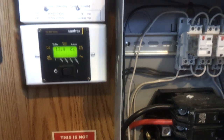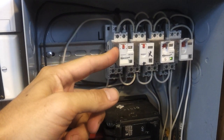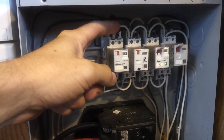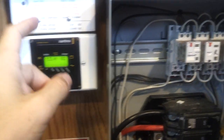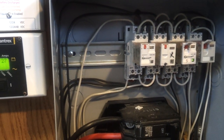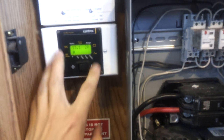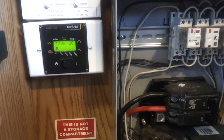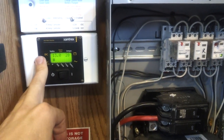That's why you need a double-pole double-throw relay — it switches the neutral as well. If your inverter didn't bond ground to neutral, you could get by with a single-pole double-throw switch. But to conform with electrical codes, you pretty much want your inverter to have its own neutral-to-ground bond when switched on, because if you're boondocking without an external bond coming into the panel, you won't have that safety bond anywhere — which is a concern in an RV or boat situation.